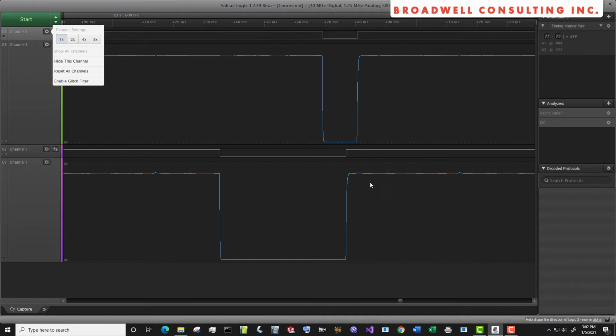If I was doing something with a car radio, where I really want the user to be happy, I don't want it to seem glitchy, but if I miss 1 in 1,000 pulses because of some noise or exceptionally long bouncing or something like that, then I probably could get by without the RC caps.